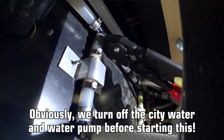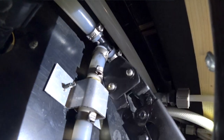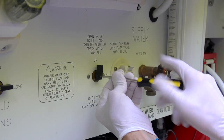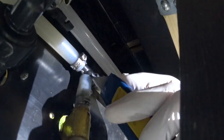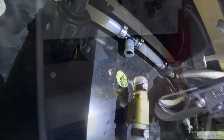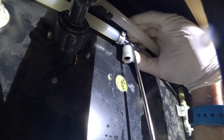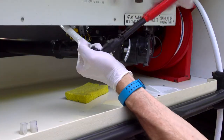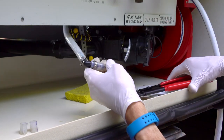To get started, we'll use our PEX tool to pry off the crimp ring that secures the valve to the main water line. We grasp the nub on the ring and twist it back and forth. Since the T in the line is plastic, we're careful not to apply too much pressure so we don't break it. We can unscrew the handle from the valve and the two screws that hold the support bracket in place. With the crimp ring removed, we score the PEX hose with a utility knife so we can get it off, again being careful not to damage the plastic T. This allows us to flex the pipe away from the panel enough to use our cutting tool. With the valve out of the way, we used a small flat blade screwdriver to gently pry the pipe from the T. We continue dismantling the PEX connections until we've removed everything from the elbow that connects to the hose leading to the freshwater tank.